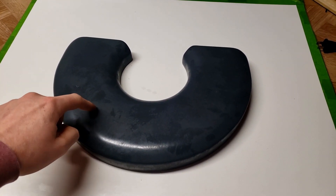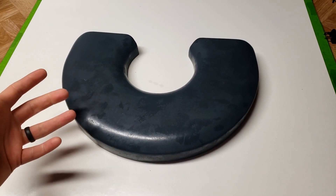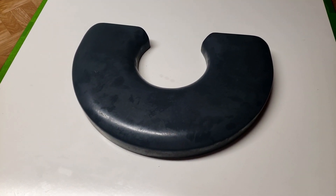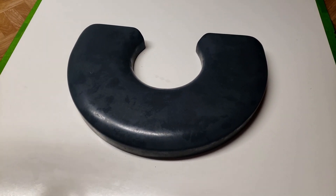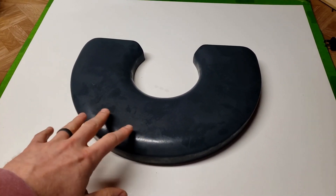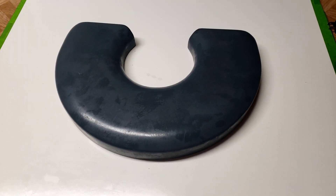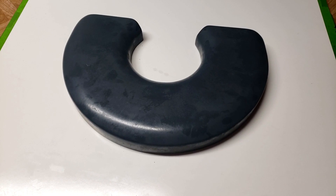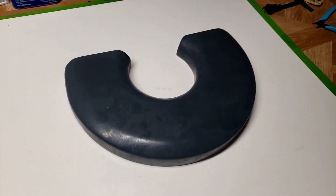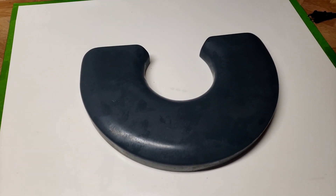Cosmetically I'd like to have the cosmetic showing piece against this surface but that's not going to happen. We are going to use peel ply and all the traditional stuff from the previous videos for vacuum infusion, but we're going to post-finish the peel-plied surface afterwards by coating it again in resin, then wet sand and finish it. We'll have a nice cosmetic part on both sides. It won't be quite as nice as if I made the female mold, but you can't really see this part from under the hood, so we just want a good strong part.